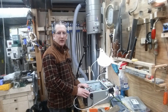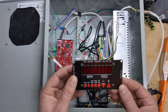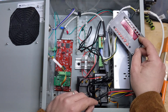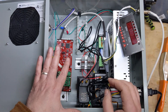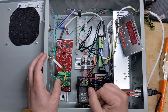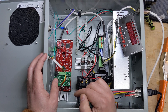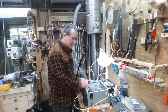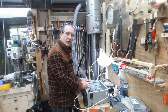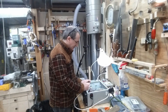When I plug it in and turn on the power, the control panel doesn't light up, which could indicate a problem basically anywhere. I should see a little message scroll across here and get an RPM readout, and none of that is happening. I suspect I may have done damage to the board at some point. There's a series of jumpers that really should not be in the position they are now when you've got both USB and external power hooked up, and I think I might have done that — so it's possible I damaged the board. I can't even get a simple LED blinking light program to work, so I think it might be the board. I've ordered a replacement and I'm waiting for that to come in to see if that's the problem.